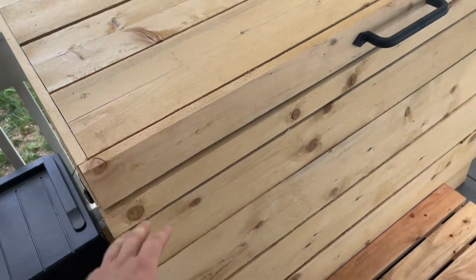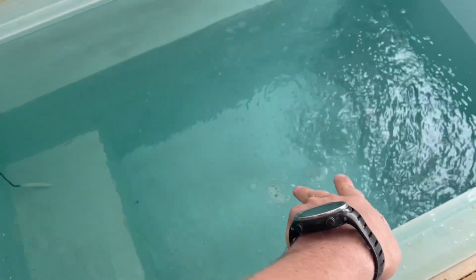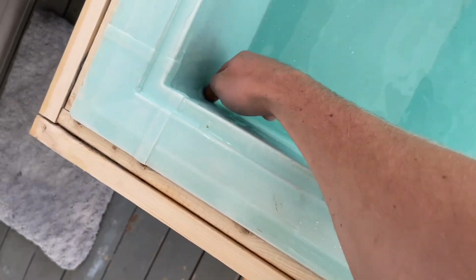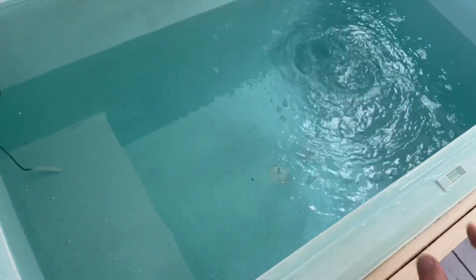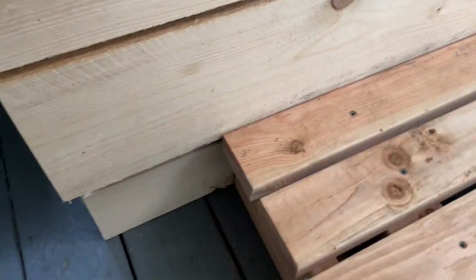So here we go. First off, this is a 10 cubic chest freezer, and what I did is drill 2 holes in the bottom. But first I actually did pond shield. This is pond shield. And there's JB water weld in all the corners. Did all that, and then I pond shielded it. And then I drilled the 2 holes very carefully so I didn't puncture any cooling lines. And then I used through holes. Oh, it's all secured. Can't even show you.